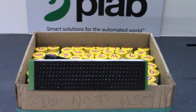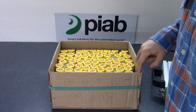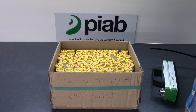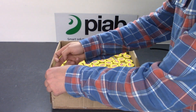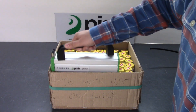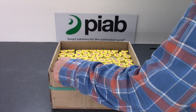This will be useful for a couple of reasons. The main concern with this application is the edges — the containers on the edges of the array. You can see there are gaps. Also on this front left corner, there's a little lip on the inside of the box. This might be troublesome when trying to place the unit straight down from the top — it might catch on this edge. It would suggest using a box that doesn't have this lip on the inside.